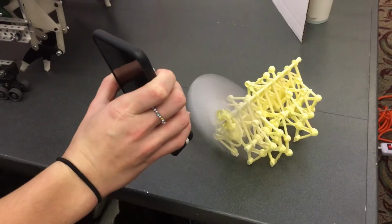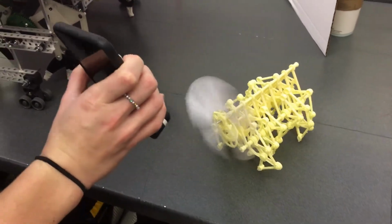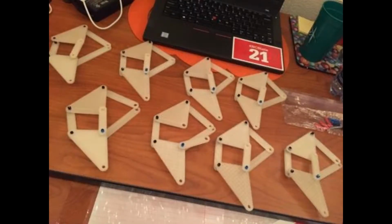The inspiration for our leg design came from Theo Jansen's strand beasts. We used a computer simulation to get the dimensions for the leg parts, which were then 3D modeled and printed to fit those dimensions. The legs of our project were 3D printed from designs that we drew. We used the Lulzbot Mini 3D printer and PLA filament. It took a couple tries to figure out how the printing software worked, but after that the printing and putting together went smoothly.